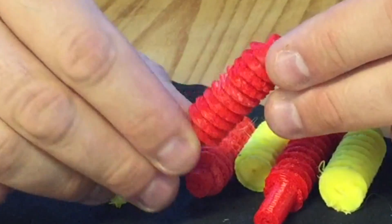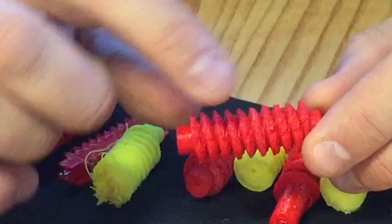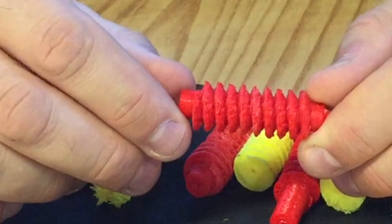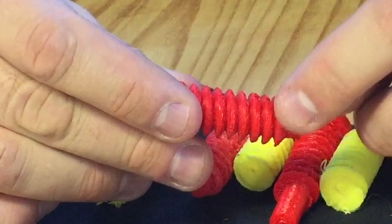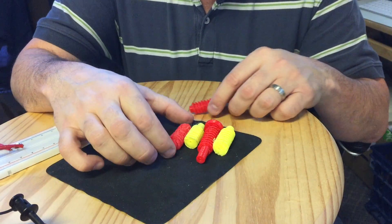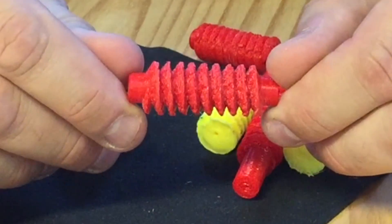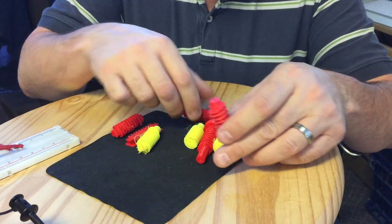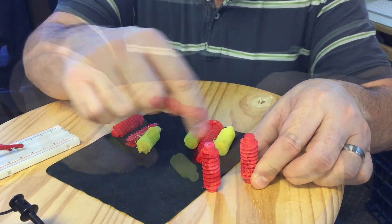So I made a minor modification to the inside and then printed a couple of samples. You can see that they're not perfectly triangular — it's kind of rounded on one side and very rough. That's because I used supports to support the teeth and it really was a mess to clean up. I tried sanding it and it still didn't work. I printed these next to each other so the head had time to cool between prints.